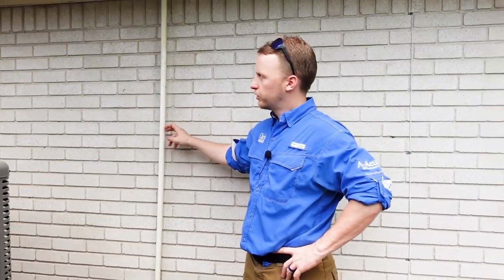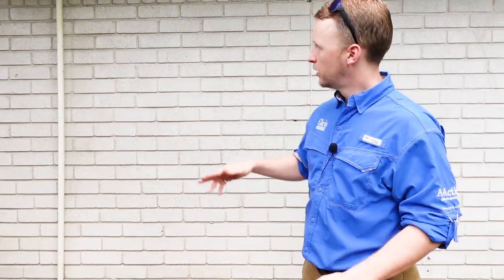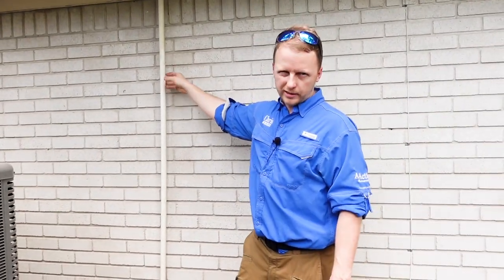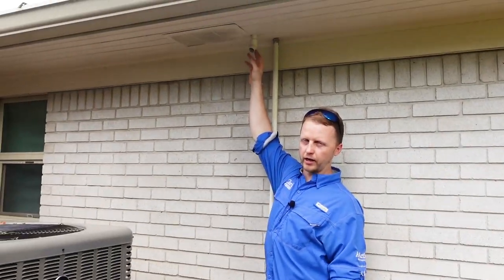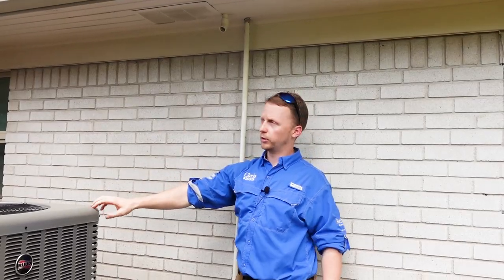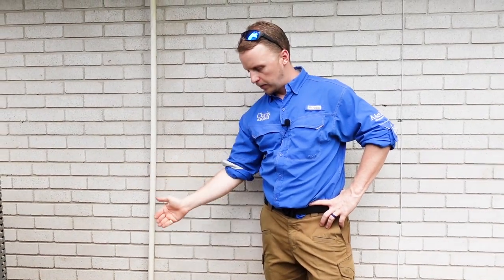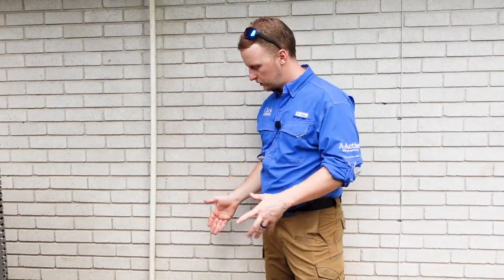One thing we spotted on the exterior is a primary drain line terminating right into the ground. We don't know if this terminates just into the ground or into the French drain system. On these older properties the primary is normally sent outside close to the ground, and then you have the secondary up here — if you ever see water coming out of that secondary it means condensation from your main unit is pouring into the attic. A good improvement would be to raise this pipe up and have it pointed further away from the structure, about 36 inches, so it's less likely to cause termite movement or moisture intrusion, and water won't clog the pipe. A minor issue but it could cause a major problem if not addressed.